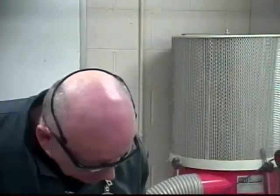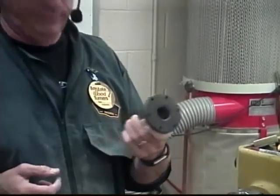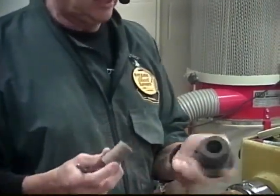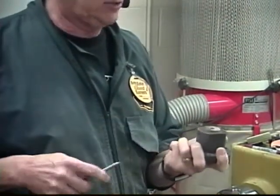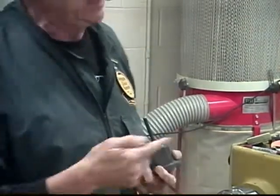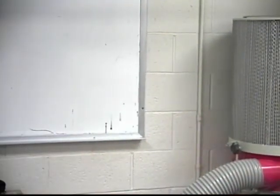I'm trying to think if there was something else. Again, I like putting the bowl on the lathe. And if you start between centers when you're roughing it out, then you'll have that mark. I know a lot of people will actually start their bowl and put them on a faceplate. And so what I did was I just turned a plug that's the same size as the hole on my faceplate, and it fits in there nice and snugly. And then I have a rod, and I drilled a hole in the middle of the plug, and then I'll just take that and tap it, and then I get the mark on the bottom of my bowl so that I know where to put the tailstock in, and then you don't have to fart around with trying to find center and making sure that you're doing that. I don't know, that was probably it.